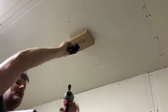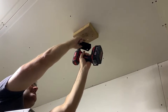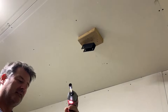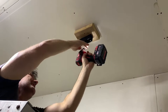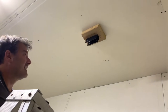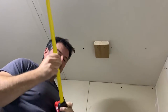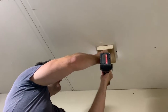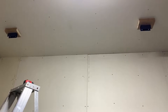We're getting ready to mount the first bracket. Using the impact driver with lag bolts — we pre-drilled to reduce the risk of splitting the block. Tighten it up good and solid. Same process on the other side, measuring off our two-foot mark to keep consistent distance. There's our second bracket — blocks are in, both brackets installed, and we're ready to put the pulley system up.